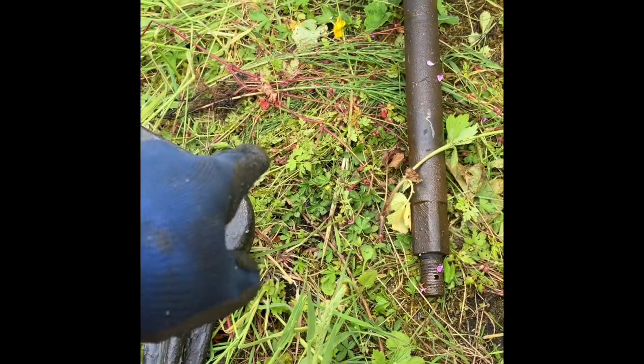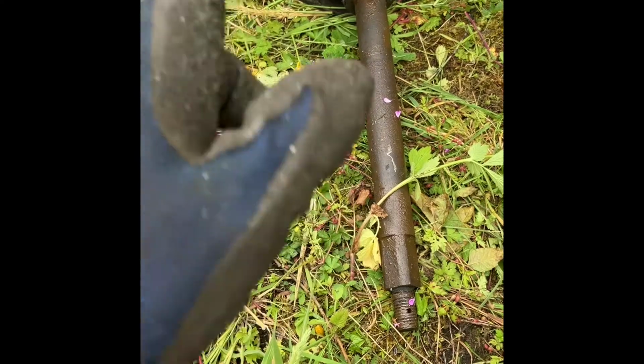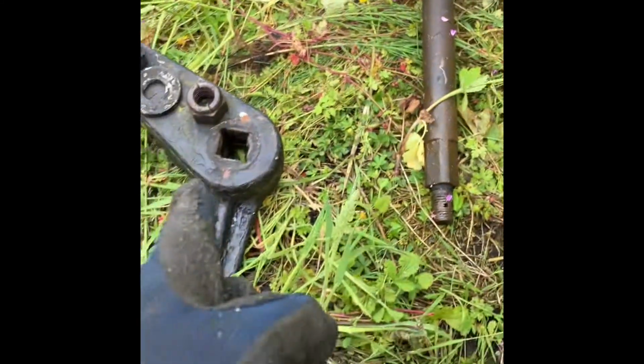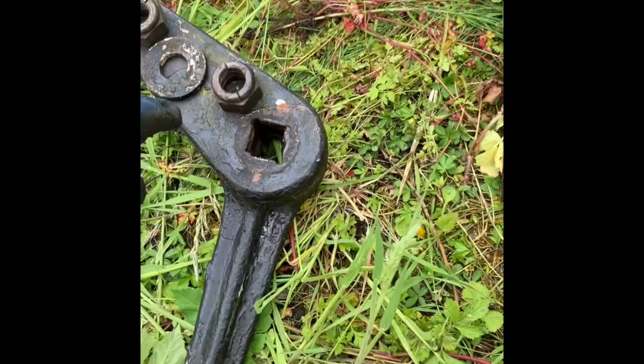These are top heavy, so when you're taking them down the signal and pulling them up, just be aware they don't catch on anything going up and down the signal. That's why I say use a rope, and if you do that over and around, it'll act as a snatch block for when you're hauling it up and down.